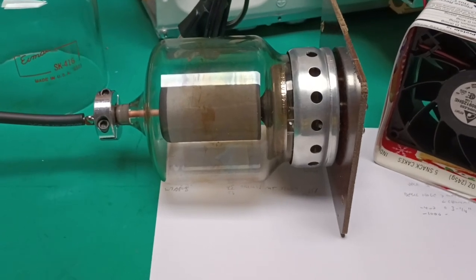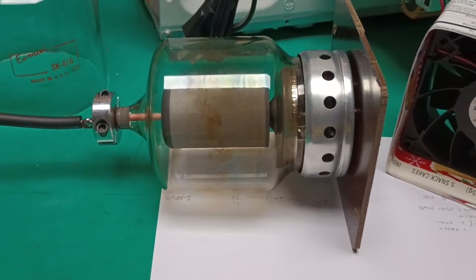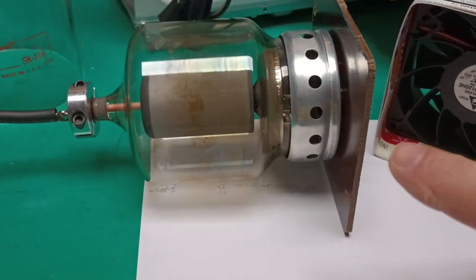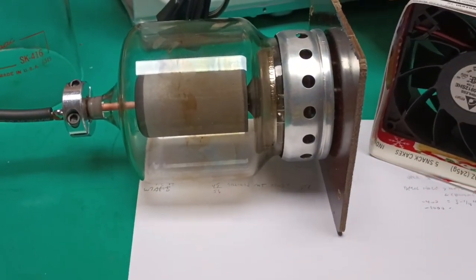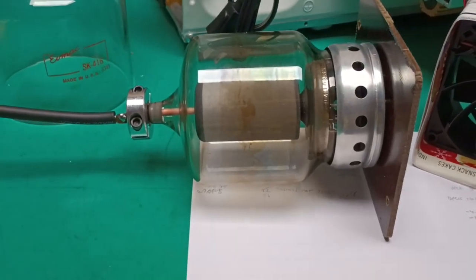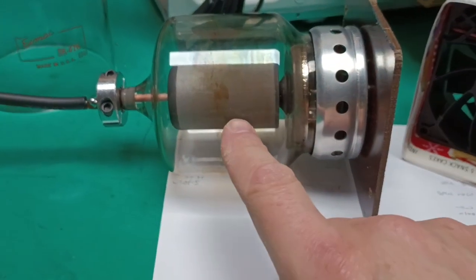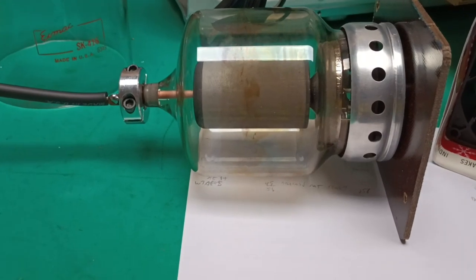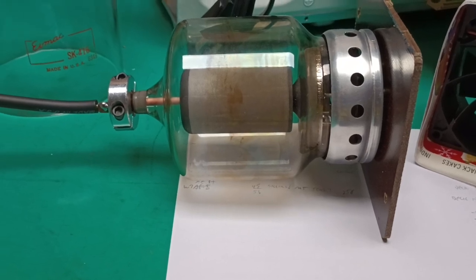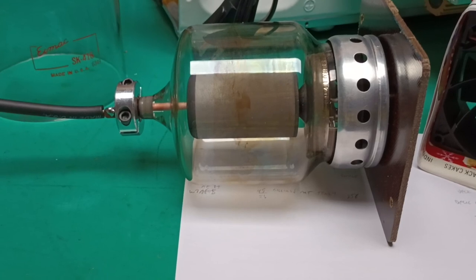First, a critical note on exactly how to install these tubes. I've seen ham amplifiers that had the tubes sitting up on the chassis deck, assuming that's the deck, and that is wrong and very bad. The plate in there gives off a tremendous amount of infrared energy. That plate's in a vacuum. It has no way to lose heat. Heat cannot transfer through a vacuum, so it emits by infrared radiation.